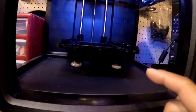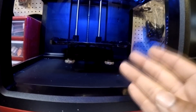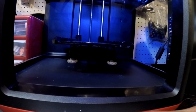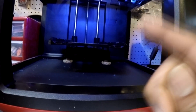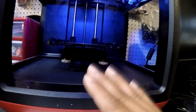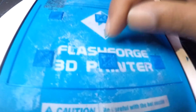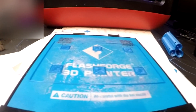So even though your settings when you're adjusting your printer are telling you okay this side is good, this side is good - I'm looking at that tray and it was at an angle. Regardless of what the printer said, I'm not sure if this is just something that happens over time. You may have to just wing it and go with common sense here. If the tray looks uneven and it's warping on that end, something's not right with the calibration. Your boy's back to normal - so let's go ahead and do that print and see how it turns out.